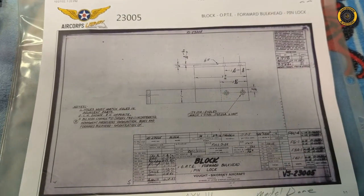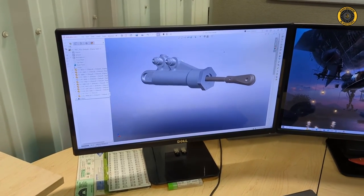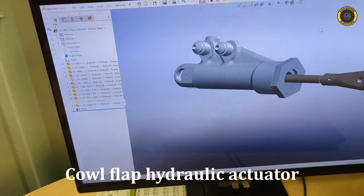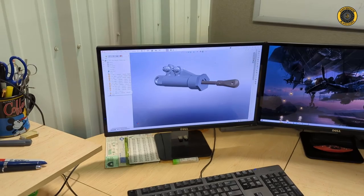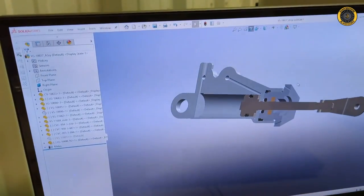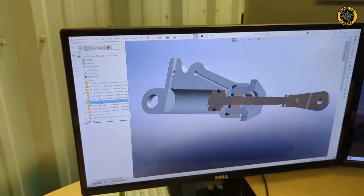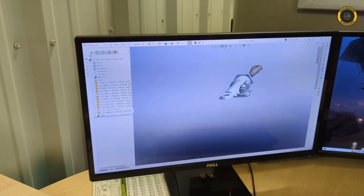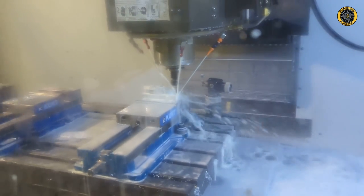Here's an example of some of the old plans. When you get those plans and verify all the dimensions from an original part, you can put all of that into SolidWorks to create the dimensions you need to make all your parts — there's the cutaway view, there's the action, all in SolidWorks — and then input it into a CNC milling machine to make the parts you've created in SolidWorks.